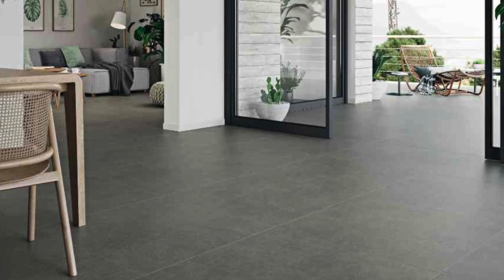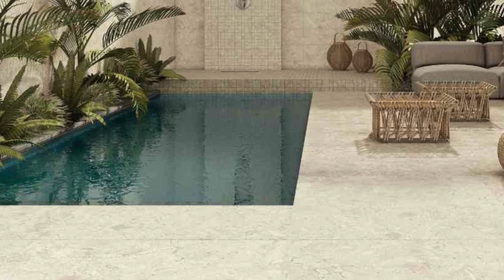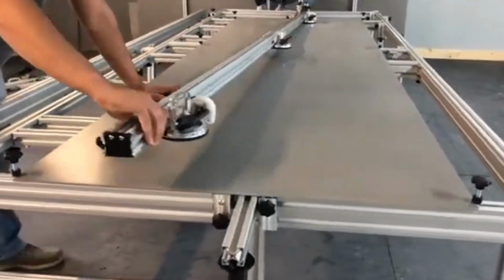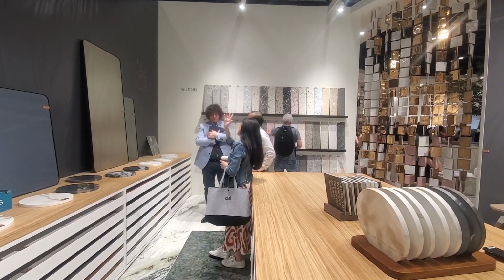Frank Donahue of Best Tile in Raleigh, North Carolina, is leading a subcommittee on one of those new topics. The issue? Helping a contractor verify that the tile specified for a wet area, shower or exterior, is applicable for that particular installation. Contractors and distributors have been telling members of the technical committee that GPTP, or gauged porcelain tile panels, have been specified for shower floors with a slope in pie cut sections, for example. Yet even though the tile may meet the proper DCOF number of 0.42 on the product data sheet, it does not mean that the product, or any particular product, is designed for use in wet areas unless the manufacturer specifically states so. Our goal is to communicate the need for specifiers to identify whether a product that's being used on a shower floor has been declared suitable for that application by the manufacturer of the product.